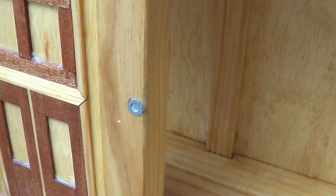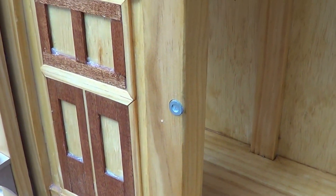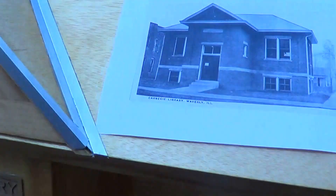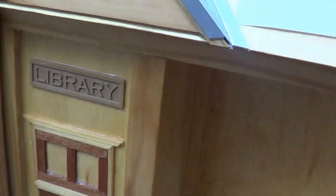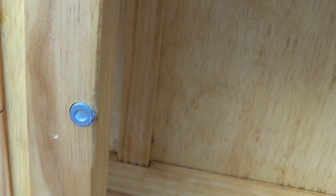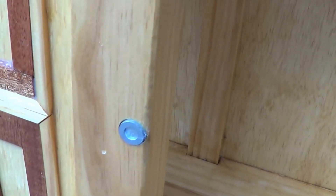The doors are actually held together by magnets, which I ordered from eBay. I was a little concerned they were very strong — that you'd even be able to pull the door open. In the end I didn't make them close all the way; they never actually touch. When I tried just putting a washer on one side and the magnet on the other, it didn't have enough sticking force. So I ended up mounting rare earth magnets on both sides. I drilled a little too deep, so I stacked some washers to get the field up a bit, and I put a little rapid fuse glue on there to hold them in place and keep them from being pulled out by curious children.